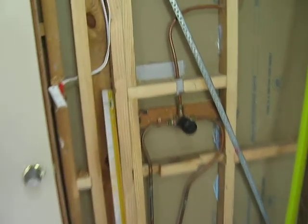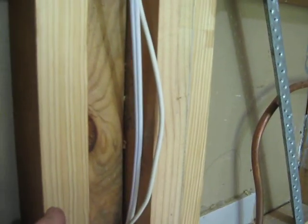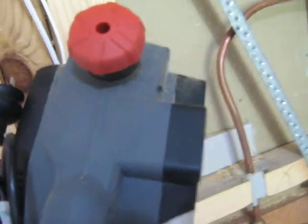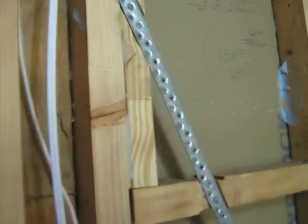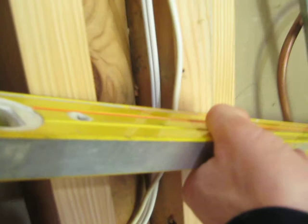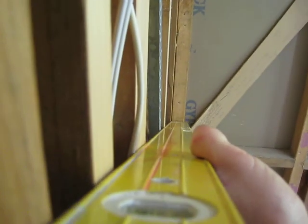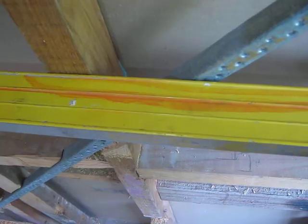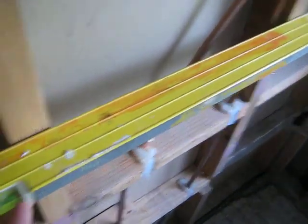You can see here that I've removed a fair amount of the wood on some uprights. I've just used a cheap plane to remove the high points. There were some high points and now it's fairly flat. I've just been checking with a straight edge. This is going to be tiled all the way up to the top, so I want the wall to be fairly straight. I've checked all of the wall for straightness and removed any high points.